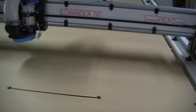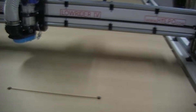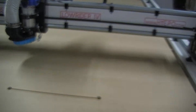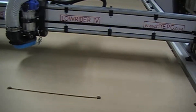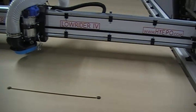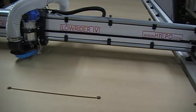The strange thing was I wasn't able to duplicate either of those weird events. But I did go back and make sure all my connections were sound and snug in the board from the stepper motors, and ever since I did that I haven't had a problem.